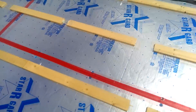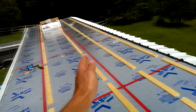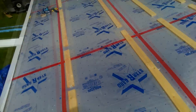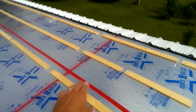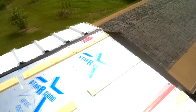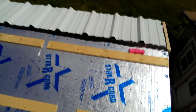Up here on the roof you'll notice I've got horizontal furring strips going. You're supposed to attach fasteners every 3 feet. I've got an extra one here and some extras on the side for attaching the gable edge trim a little tighter. Basically anywhere along the edge, that's where your wind is really going to be hitting. Make sure you have enough fasteners along the edge because that's where the wind really picks up. If you don't have the edge fastened, the wind will grab it and eventually work the screw loose. So make sure your edges are fastened correctly.